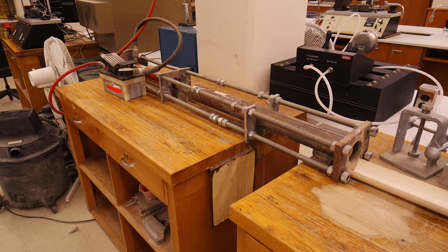The sample will come back to the lab to be logged in. We will use the sample that was called out from the engineering test program for our test. The Shelby tube will be placed in an extruder to remove the sample from the tube. Once the sample has been extruded from the tube, we will log it in and pick the area we want to run our test on.